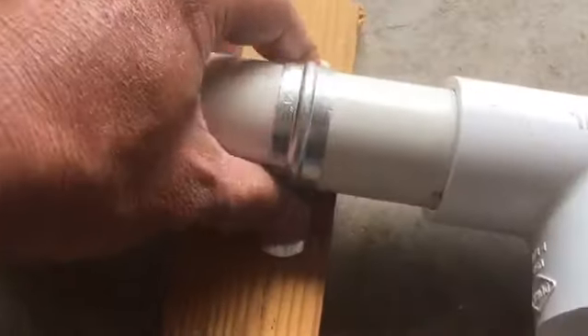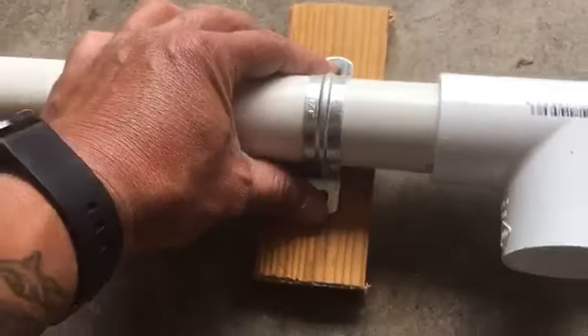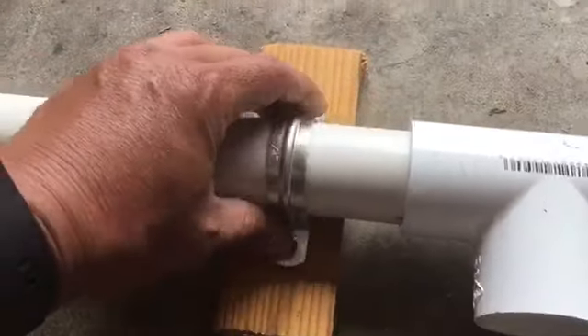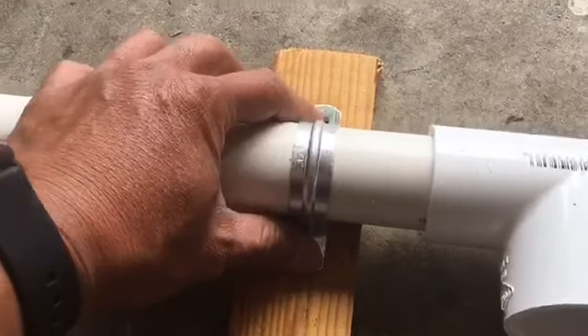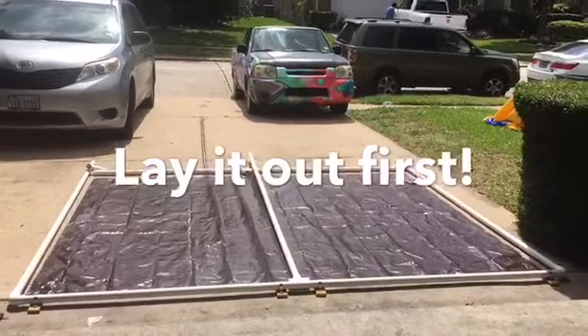That's the best way to do it — screw the spacer onto your wall, then screw the wall mount down. That way when you want to bring down the awning you still can, because it has a little plate that creates a kind of hinge.